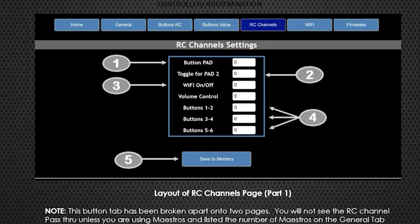You can assign a toggle switch, and when you have the 15 buttons installed, you can flip that two-position toggle switch and get an additional 15 buttons. So you can have two banks of 15 buttons on one transmitter. I use that for different robots - R2 and R5 use the same bot but I wanted different control banks. R2 on one bank, R5 on the other. You can have a total of 36 button activations on one transmitter with the full setup.